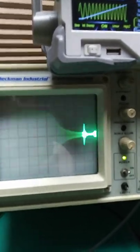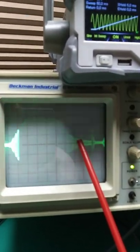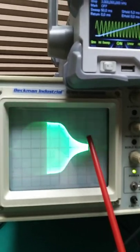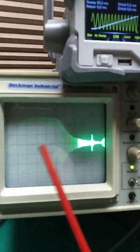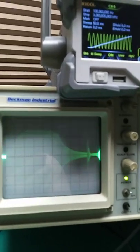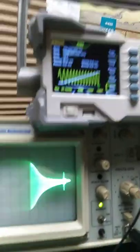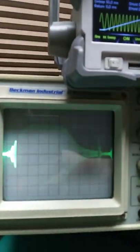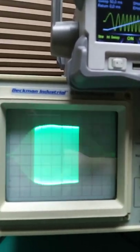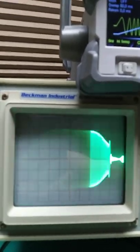The inversion capacitance, which is between the two halves, is responsible for creating that tail, and it was way too high — up here. So I had to change the value and tune it downwards to shrink that tail down. But now when I go to the RF generator, I start dialing the frequency down — 29, 28, 27, 25 — to 2,100 Hz, getting right about 2 kc.